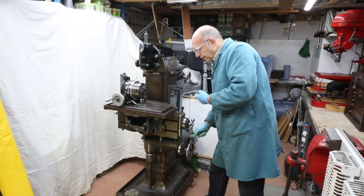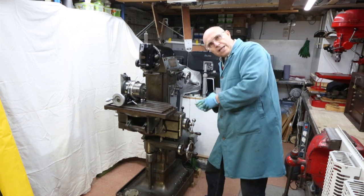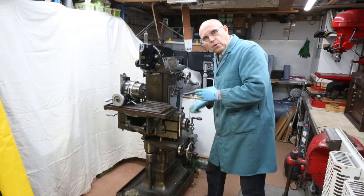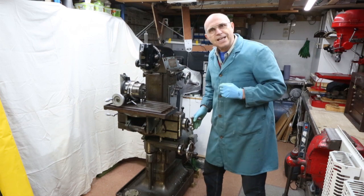So that'll be as far right that we can go. At that point we then turn the handle clockwise — that will eliminate the backlash — and now we can start turning it clockwise until we get the centre over the join that we want to measure from. So let's get on with that.